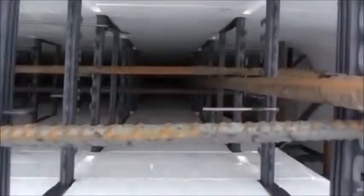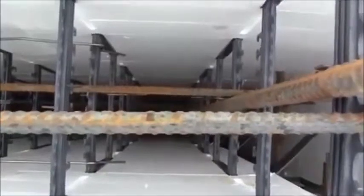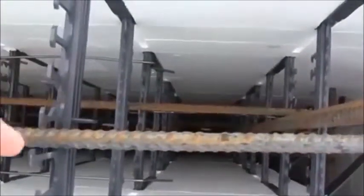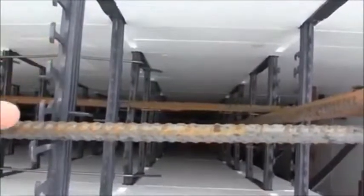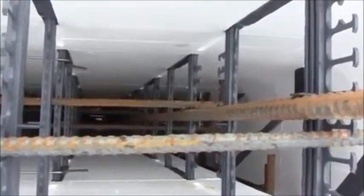If you look down, you can see the horizontal rebar is on either side of the center hole. This is the center hole right here, and we went on either side, back and forth, staggering all the way up the wall. Then our vertical rebar just weaves down in between that, and that keeps it in place during concrete placement so we're guaranteed it's going to be in the right spot. Very easy build.